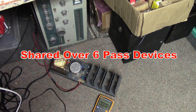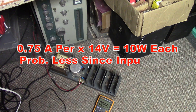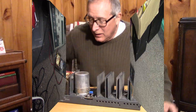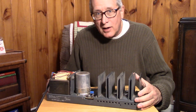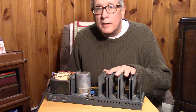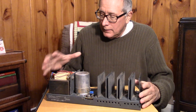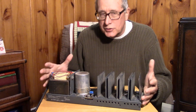A lot more to go on this. I have to put protective circuits on, off switches, indicators, line cord stuff - all the regular safety things. But basically, the simple linear power supply is working. So I think I have a working foundation for a power supply. I've tested it on one of my military receivers that has a dynamotor on board. Next, I'll be adding some filtering, proper switching, and protection circuits.